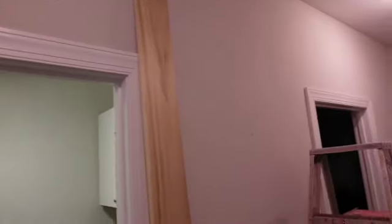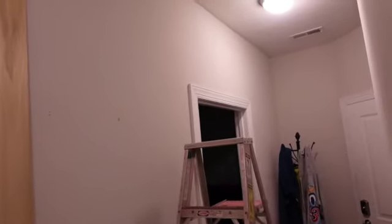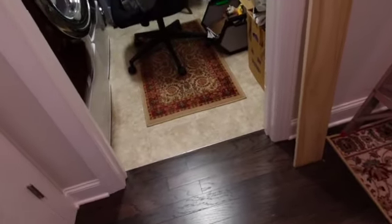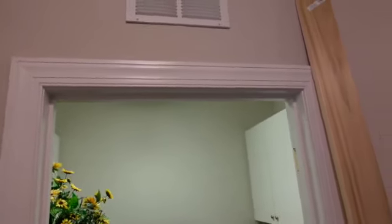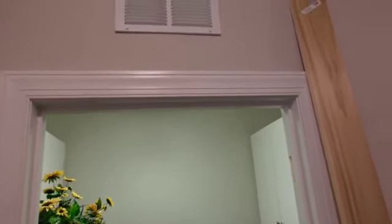So I am going to tack up this board with some type of drywall screw above that door and run the board from upper casement to upper casement. Then I can get an idea of the length of the barn door to the floor. And this is actually fouling. I'll have to rip this probably 1/4 inch to get it to go. I probably could mark it and get the router, but it would look funny to have an inset. I can do anything I want, but I think that would look kind of crazy.